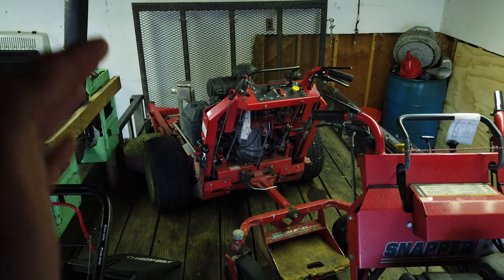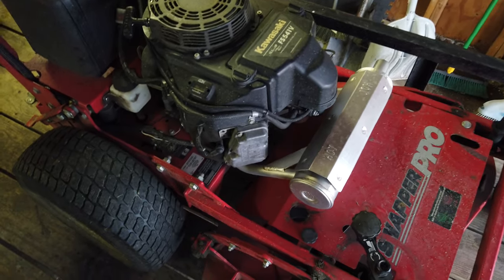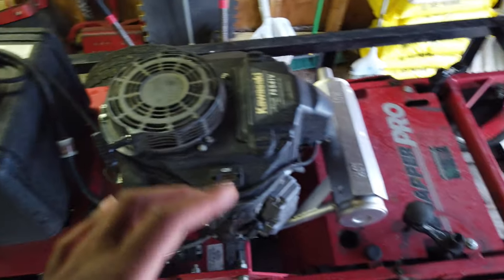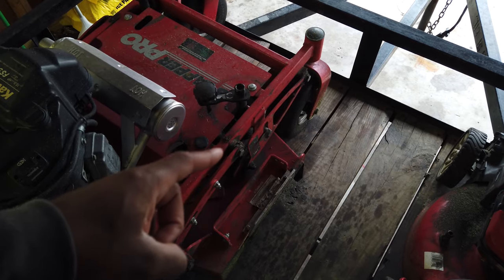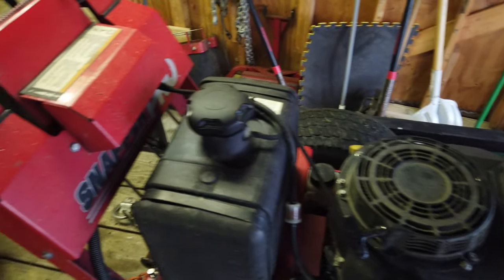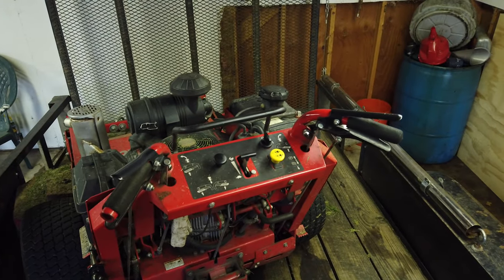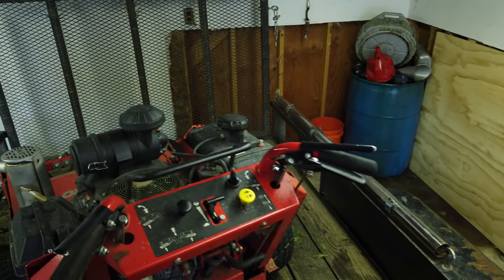These mowers are built well, built strong - as long as you maintain them. I like to grease my wheels and spindles every other day or so. If you grease them too much it just gets messy. I like the Toros that don't have any grease fittings, but I'd like to see a machine without grease fittings on the deck height adjustment while still having grease fittings on the spindles and wheels. Going to a Ferris means I'm going to a dealer about 20 miles away - a really good dealer. There's no really good dealers near me; my current dealer is smaller and there's always a long line, though they're great guys.